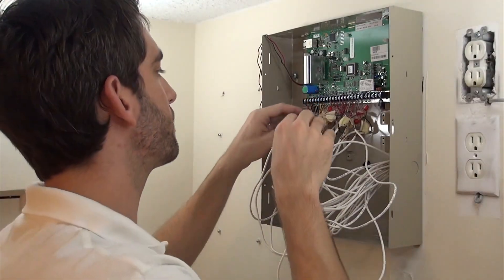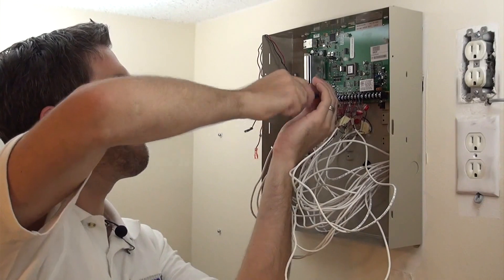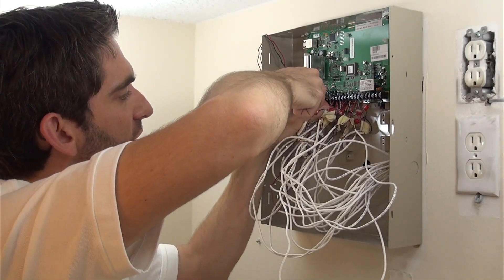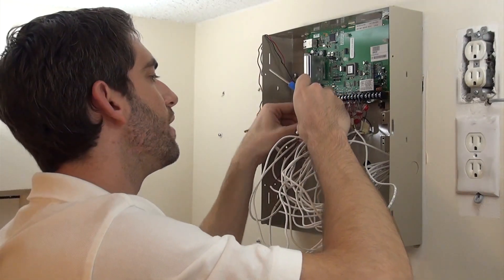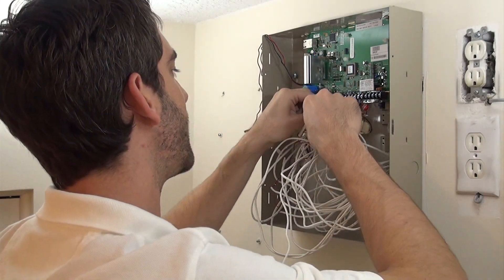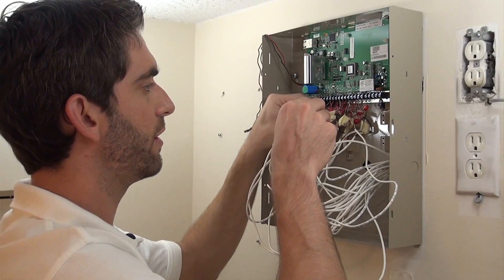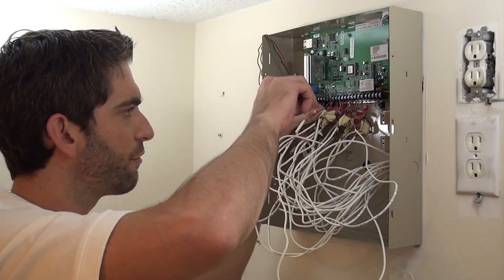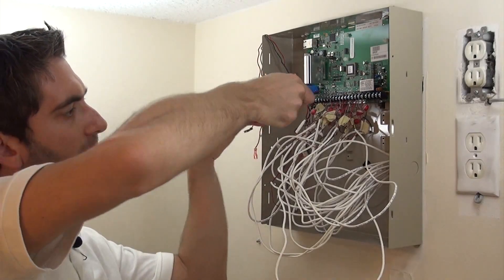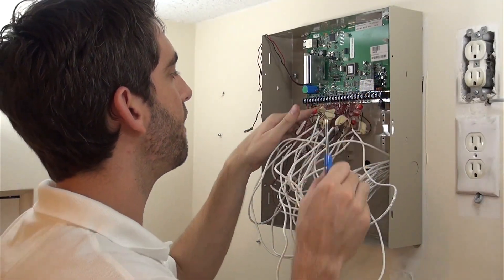To recap — I've got a loose one. Always good to check your connections when you're done. Let's go ahead and tighten that in. You want to make sure these connections are good, otherwise you're troubleshooting once you power up — you'll have zone faults. With all these connectors in here it's a little harder to work with, but if we loosen up our wire it gives a little room to slide it in, then nice and tight. Give a quick little tug to make sure we don't have any loose connections — and we do not. We're good to go.